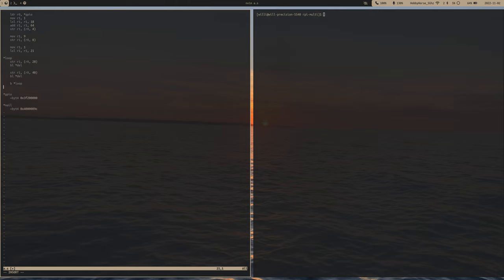And for our delay function, let's just say we'll move one. Well, yeah, let's use R2. Let's move 1 into R2 and then shift that over. 21 is a good number. And then we'll say while not 0, we'll subtract 1 from R2, if I can type, and then branch if not equal back to the while loop if it's not 0. And then we'll go back to our link register. So this is our little delay function, and then I'm satisfied with this.